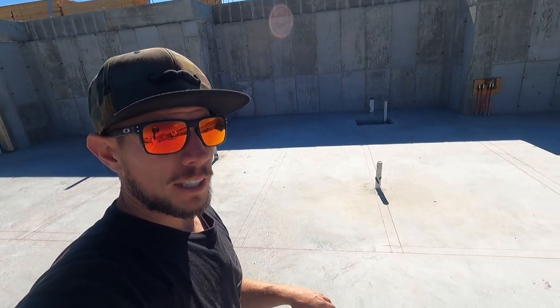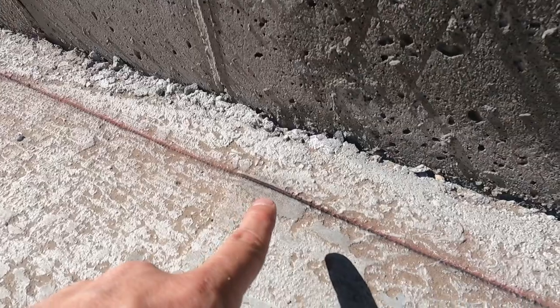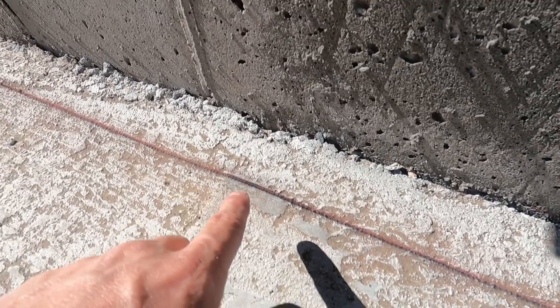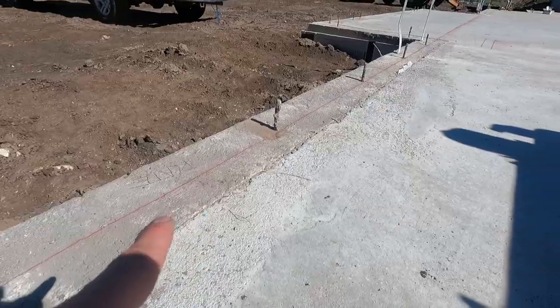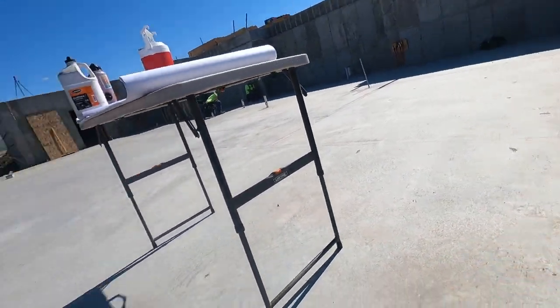For the past few hours these guys have been here marking out where every single wall is going to go. All they do is take our prints and chalk line them off. But first, before they start anything, they create what they call a base square line. This chalk line right here is intense — it's red and black because it is their baseline. This is the square line they made, and they square it by taking a dimension there to a dimension here.